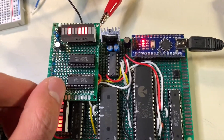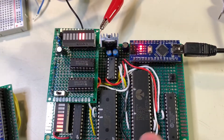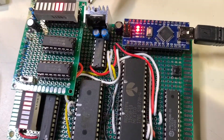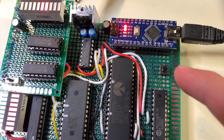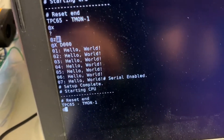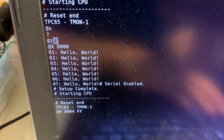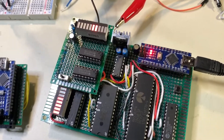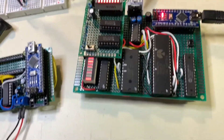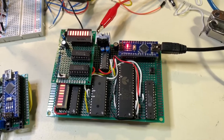I can flip this switch to set it so it can only be accessed from its particular memory address. If I reset this — I have a button up here for reset that I haven't actually wired in yet, so I'm resetting it from the Arduino. This will tie into the NMI, which will allow me to reset it without having to reset the entire Arduino. If I do 'write 8004' and then 'FF', you can see all those lights showing FF in that particular register. But as I said, it's pretty slow because I've intentionally slowed it down.